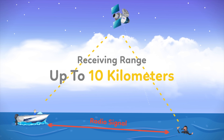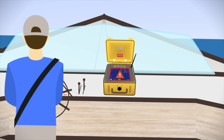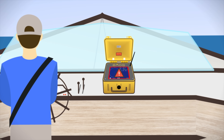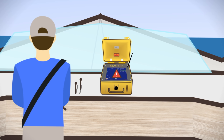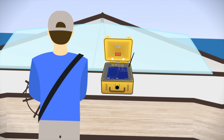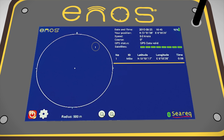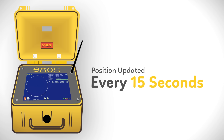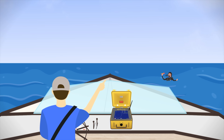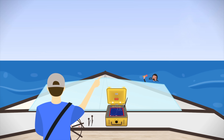The person responsible for the receiver will hear a very high frequency noise signaling a diver in distress. The alarm will only stop when the responsible person confirms the reception of the emergency signal on the receiver. He will then see on the display the exact coordinates of the diver in distress. There is a position update every 15 seconds, and the person can then proceed to find the distressed diver by following the coordinates displayed on the receiver.